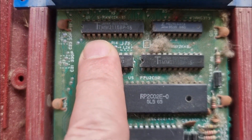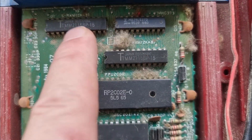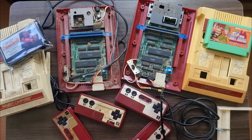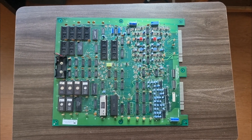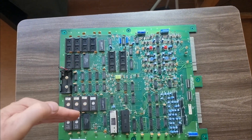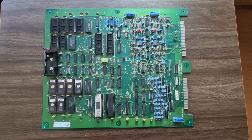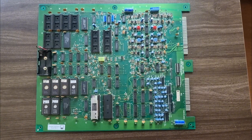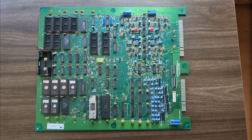The really only other difference is that your ROM set is stored on a cartridge, and the memory is only 2K — this is a 2116 versus a 6116 on the Versus system. I was hoping to be able to use these Famicom RAMs but I cannot use those on the Versus. So essentially, Nintendo took the Famicom console and made the Versus by putting two consoles on one board, four controllers, and giving you two video outputs, one for each monitor.